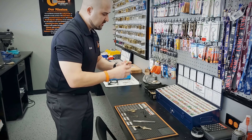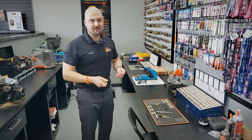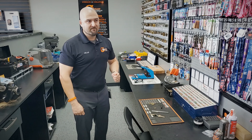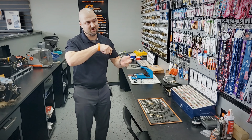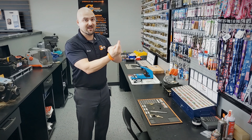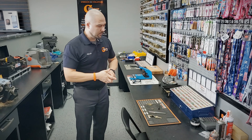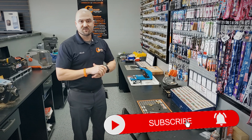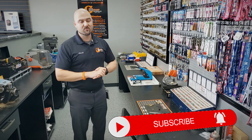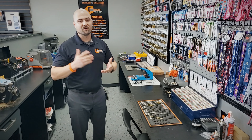So that's how you rekey a Schlage Everest cylinder. Like I said, it's not a restricted keyway — it's just a little extra security, harder to get key. Also way harder to pick, because you have to get that pin lifted up. Even if you get it picked over, you still have to get that last finger pin up and out of the way in order to get the cylinder to turn over. We're going to continue to put out videos — we got a little behind because of the coronavirus, but stay tuned for more content. Please subscribe to our YouTube channel, like the video, and follow us on Instagram, Facebook, Twitter, and LinkedIn. We appreciate the support.